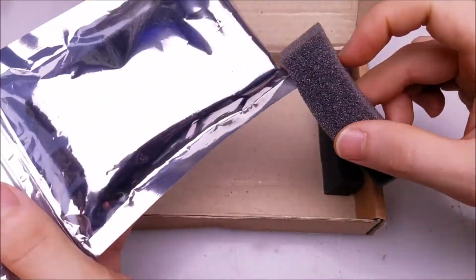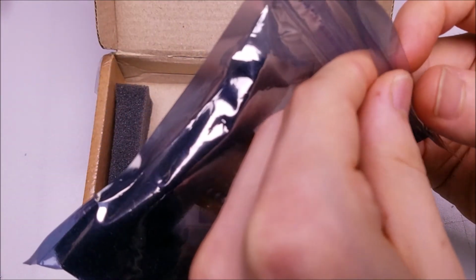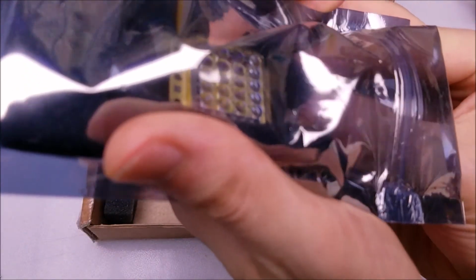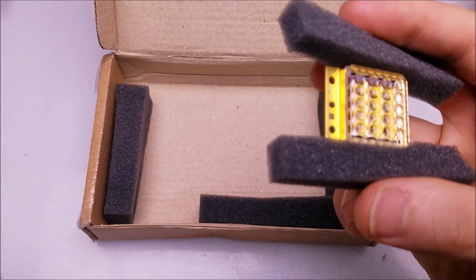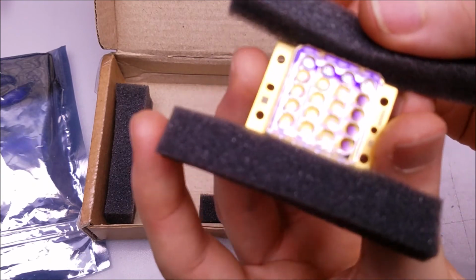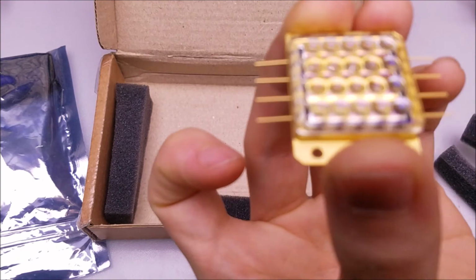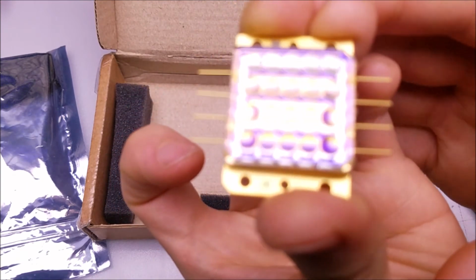You've probably seen the blue version of these, as they're quite common. But these are multi-laser diode packages, and they use them in video projectors as a light source. So this would actually be used instead of an LED or a high-intensity discharge lamp, but they're more efficient. That means they run cooler and produce light with less energy. Anyway, as you see on my test load, where I had 4 strings of 5 LEDs in series, this is also set up the same way.